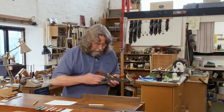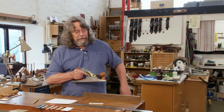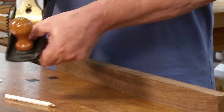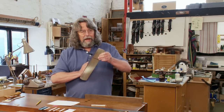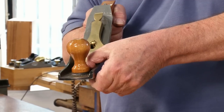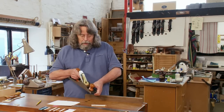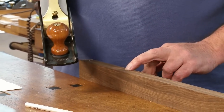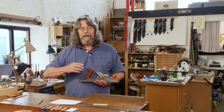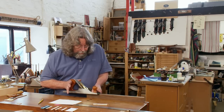The squiggle shows you where you actually started and stopped. It's important that the plane, with its curved blade, is centered on the timber. I use a thumb on top and my fingernails form a fence underneath — a sort of pinching action on the plane. When you start the shaving, it's the thumb pressure over the centre of the work that's doing all the work. Some beginners grip the back handle much too hard and tend to twist the plane off the surface.